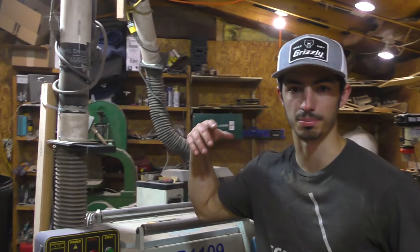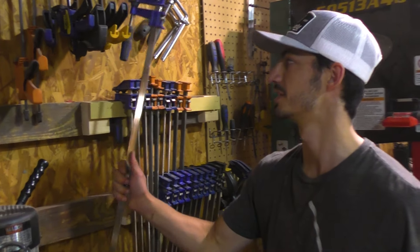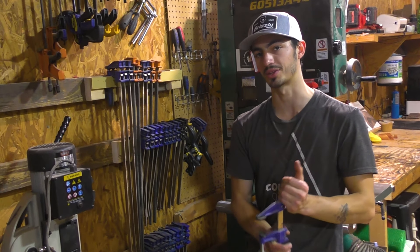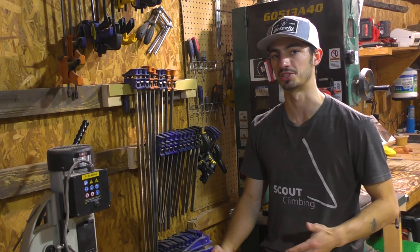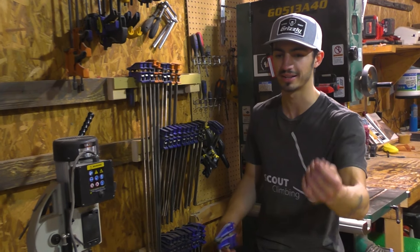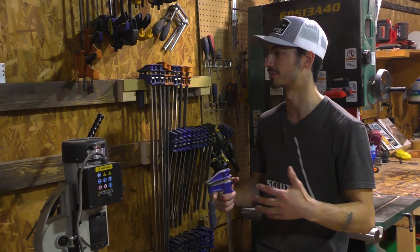Oh, the best thing about the dust collector — from anywhere on the property outside my shop I can turn it on and off remotely. That's really unique and cool. I just open the blast gate accordingly. My clamp storage is kind of janky but it works. I really recommend Tay Tools clamps — this is all you need. You don't need fancy parallel clamps or bar clamps. If you're putting more than about 10 pounds of pressure on your wood something is cut wrong or there's dirt in the joint. Everything should fit together cleanly without a clamp — the clamp is just there for moral support.